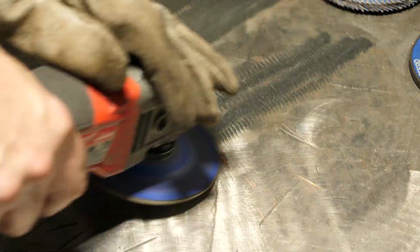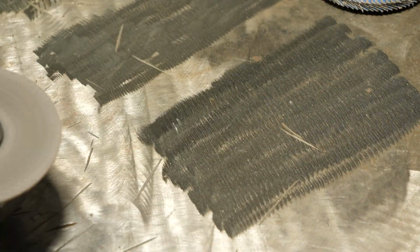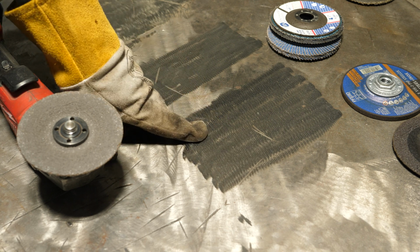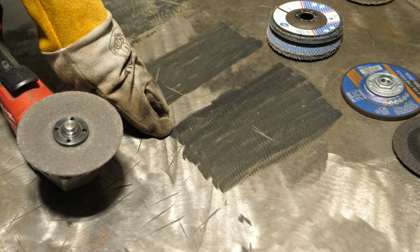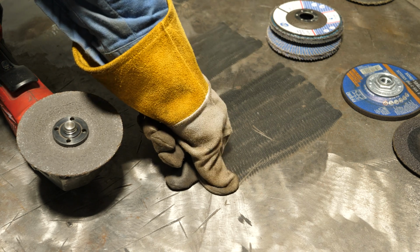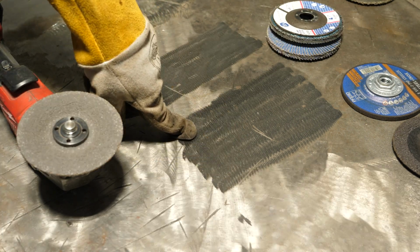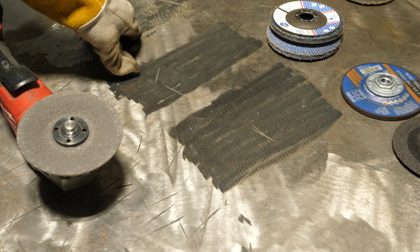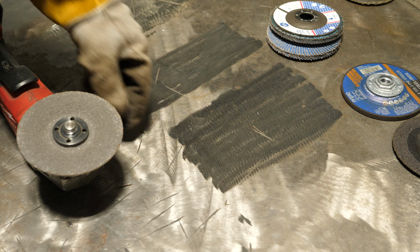So I got that oddball ceramic carbide, or who knows what it is, and let's give this a shot. So as in the previous test, it cut much faster, I would say, than the others. It's a slightly wider cut, so it's closer to maybe an inch or 3/4 versus like a 1/2 inch with that dual disc and like a 1/4 inch with a Hard Rock.